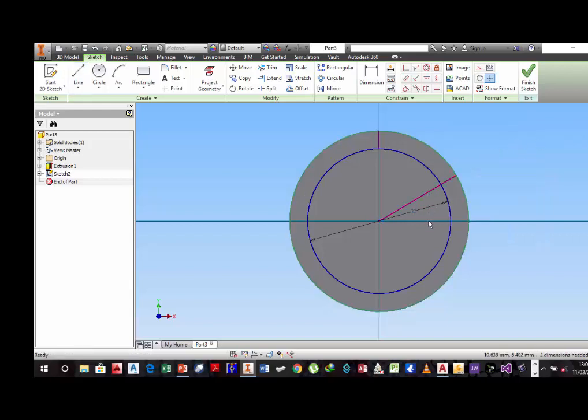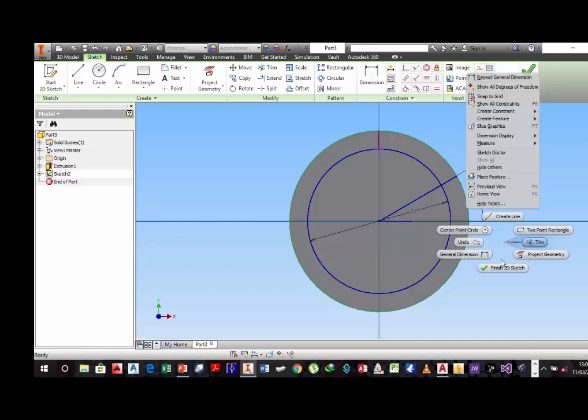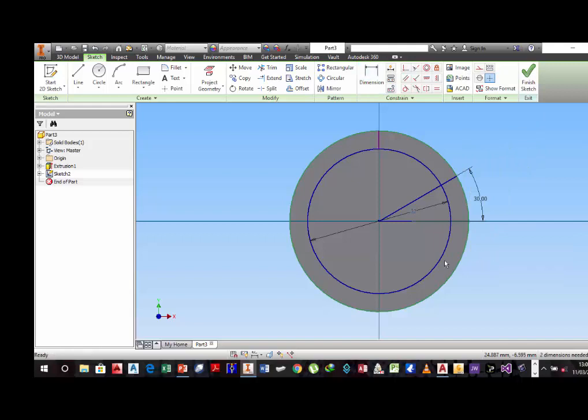So click on line on the center, then click OK. Go to dimension, and let's see how dimension looks like. Oh, you see 30.54. So we have to edit it to 30. Press enter. Beautiful. So we have to now delete the line that we have formed, so we don't actually need it. So delete it. That's beautiful. So we're able to get this line now.